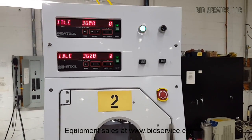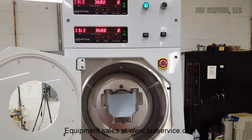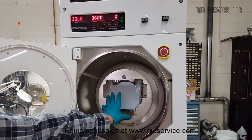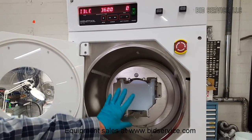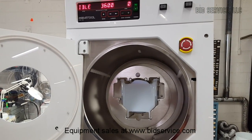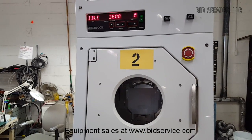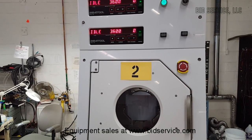When you have nitrogen flowing, these doors do have an airlock. Since we're in idle mode, we're able to open them up, and as you can see inside here, we have a rack of wafers loaded. To test this, you need a full rack of wafers, and it tells you right here on the rotors what wafers and what rack you need in there for that particular rotor.